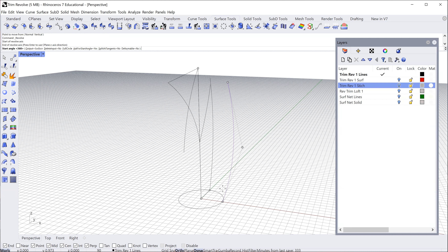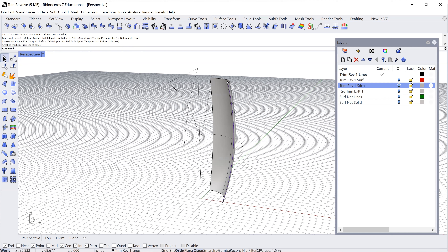My orthographics are set so it's snapping every 90 degrees. I want a partial revolve — I'll start here and snap over to 90 degrees and click. There is my partial revolve. I'll look at this from the top view and rotate it to the front on center using a numerical value. Rotating 90 degrees brings it to one position, then another 45 puts it on center at the front — so that's negative 135 degrees total.